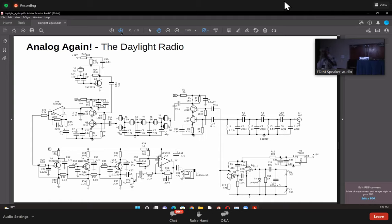And you see here, this is the carrier, and this is almost 40 dB below. And I think this 40 dB below is because it's leaking through somewhere else. It's not because of the NE612. And this is the